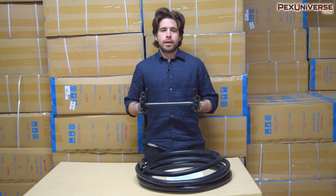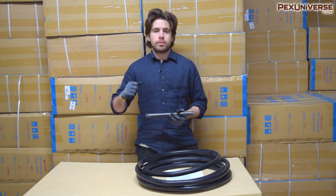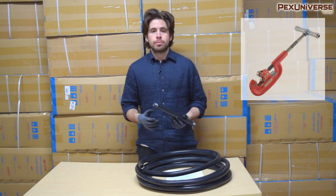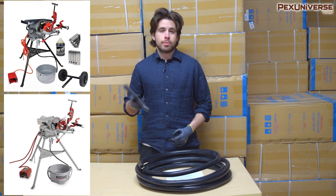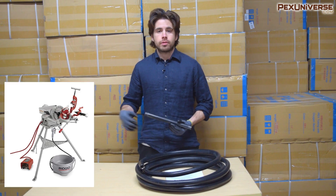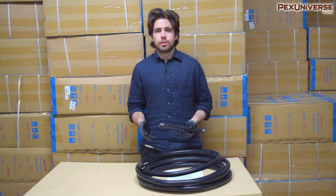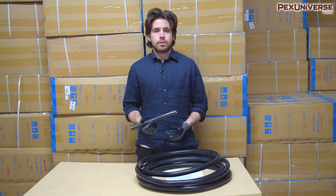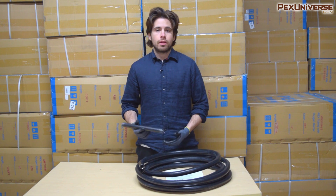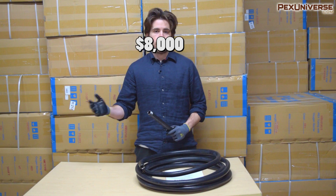This is 25 feet of CSST and it's very light. Black iron pipe usually needs heavy machinery to cut and thread — you can sometimes get away with a handheld tool for a small installation, but if you're a professional you probably need a big threading machine. Black iron pipe has been around forever so there are very reliable machines, like Ridgid. I've talked to one contractor who's had his threading machine for over 40 years and it still works. But if you're a new contractor, CSST lets you avoid buying one of those machines, which costs at least $2,500.